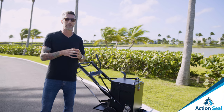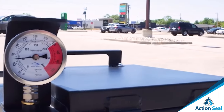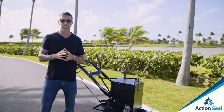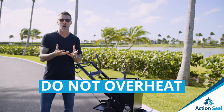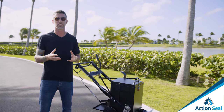In regards to the RY10 Pro, it has a glycerin-filled temperature gauge right in front of you, allowing you to see that same temperature and consistently keep it at 350 degrees. If you overheat your machine, the crack sealer crystallizes on the bottom and turns to almost like glass. You don't want that because those chunks can block your valving system.